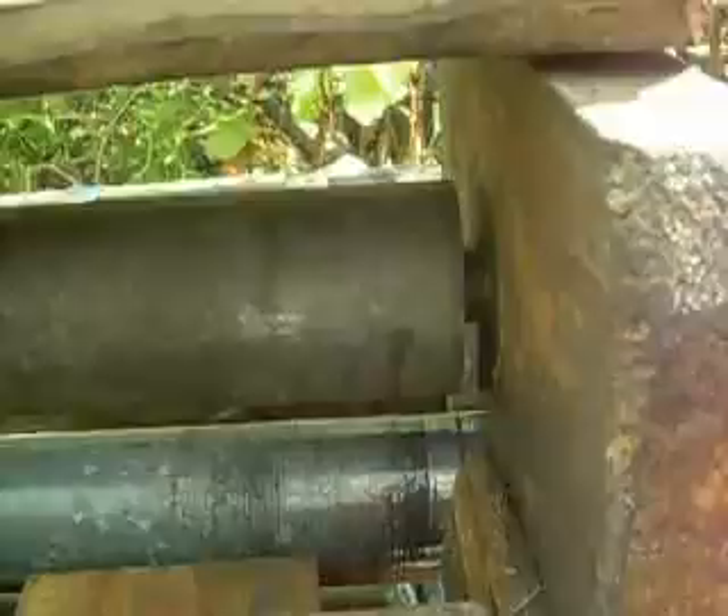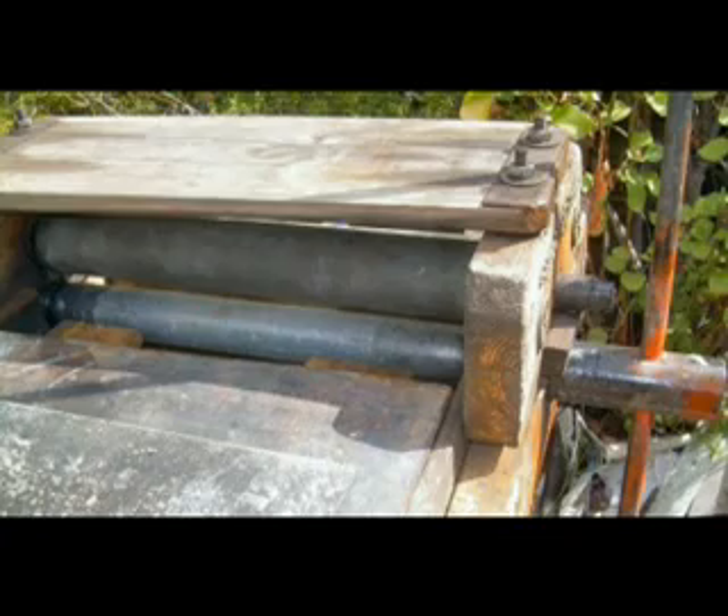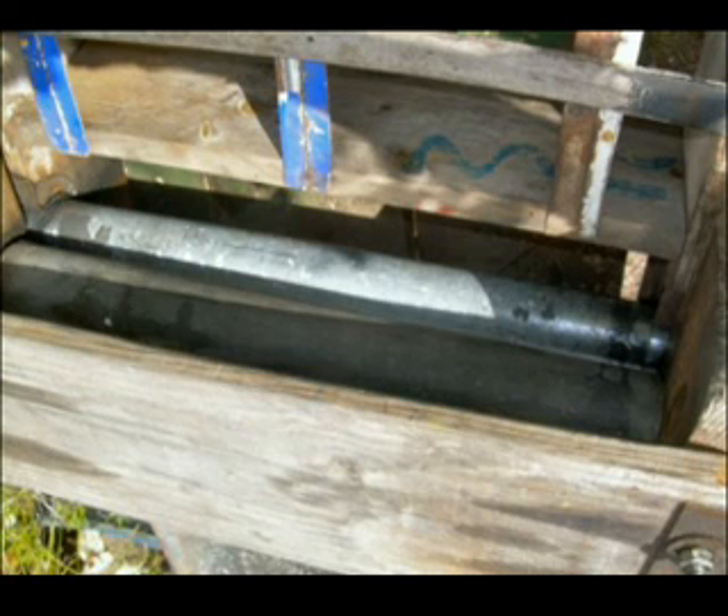One is a metal tube. There you see the screws for adjusting the pressure on printing. I was moving the upper roller. You see the metal tubes which are filled with some stones and cement and some armoring iron. This is a view of the two rolls. Let's remove the printing support plate — in the buff you see a plate with two screws, and with these screws you can adjust your pressure.